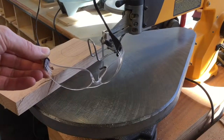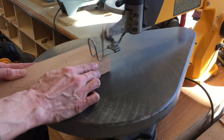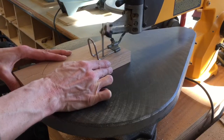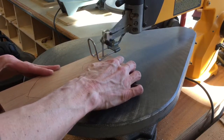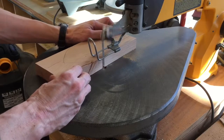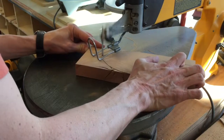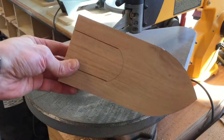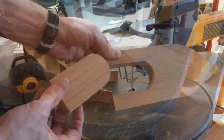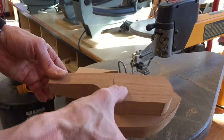Make sure to wear your safety glasses. As you're making your cuts, try to stay as close to the line as possible — the better job you do here, the less time you'll have to spend sanding later. I'm going all the way in until the curve starts, then backing the blade out and curving around the front. Once you're done the outside cuts, use one of the finer blades for that inside curve — you won't be able to curve the thick blade that much. After you finish cutting this piece out, hold on to it because that's the piece we're going to use for the cabin of the boat later on.